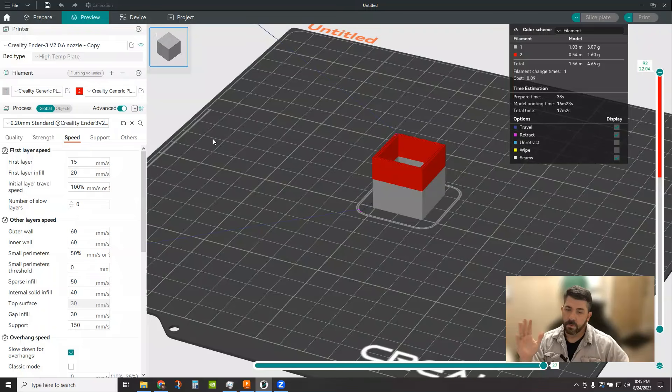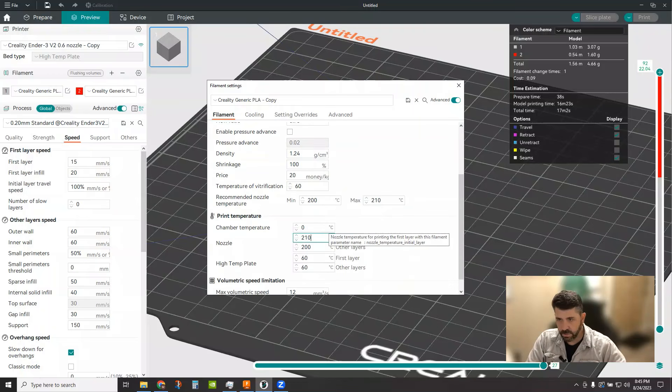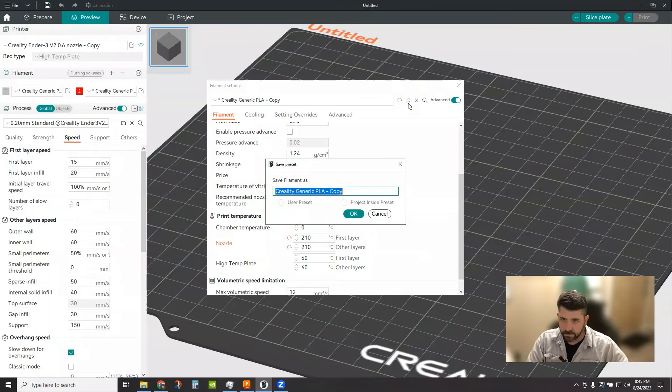Welcome back. We've got both PLAs here. Here's the scenario: I've got my default profile tuned to gray because I print it day after day — same maker, same spool, and I know it prints well at 200°C. This red filament is a bit more finicky; at 200 it tends to under-extrude and likes to print hotter. So in the filament preset, click on that filament, go to the Filament tab, change the temperature to 210, save it, and name it 'red'.